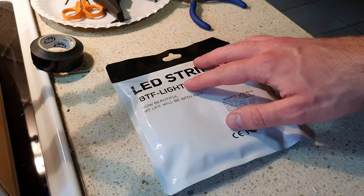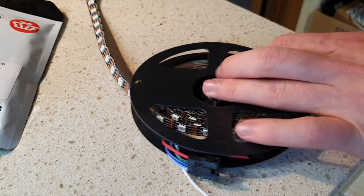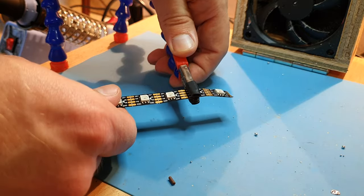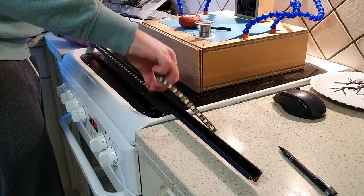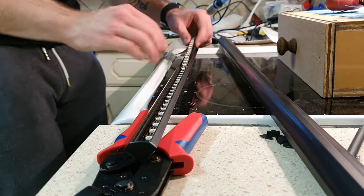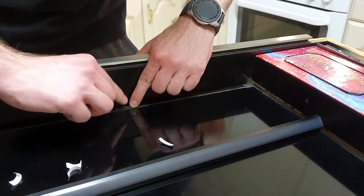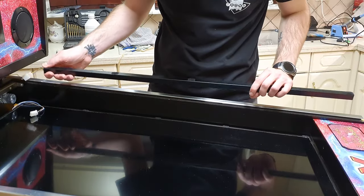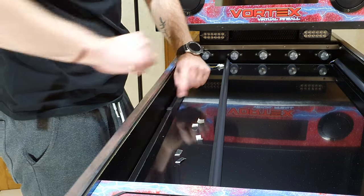At this point I had another afterthought — to add addressable LED strips to the sides of the playfield. Initially I didn't plan on doing this, otherwise I would have routed some slots into the cabinet. I don't want to route out anything anymore, so I'll make another solution. I start by soldering a connector onto a 1m section of LED strip, then grab an angled aluminum channel and lay down the strip to measure how long the channel needs to be. I cut off the excess with a metal saw and start sticking the LED strip into the channel. These channels will also act as a heatsink for the LEDs. I click the tinted plastic diffuser into the channel, then cut some velcro tape and stick it onto the playfield sides so I can attach the aluminum channel and easily connect the LEDs with their connector.